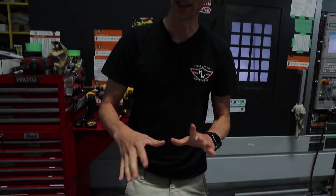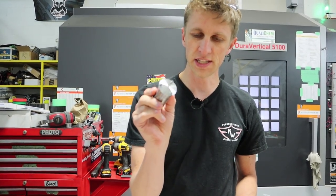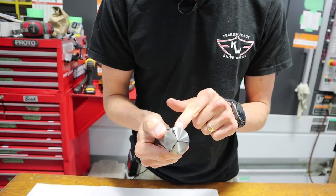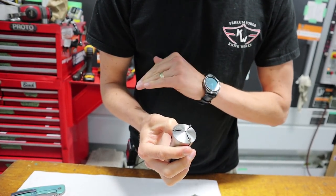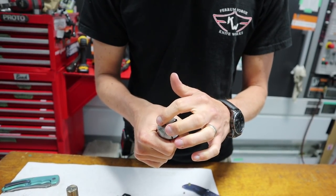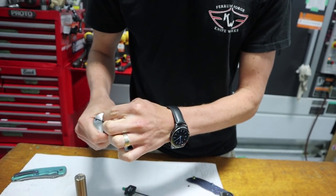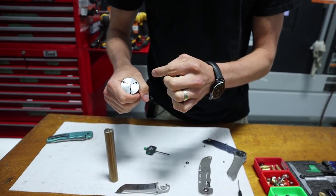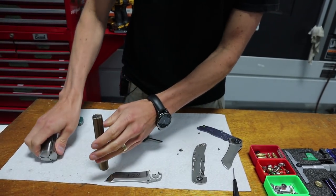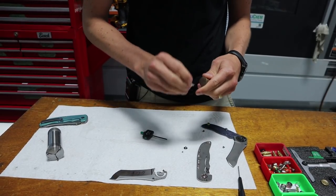It's a good challenge. I love a challenge. I think it'll work awesome. We'll use an emergency collet. So this is a softer steel collet that I can machine. So you put it into the machine, the little pins let you compress it, you mill your shape into it, so I'll mill a relief of that into there, and then pull the pins out, and then this will have compression onto the part.